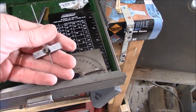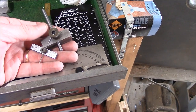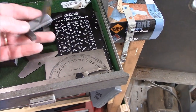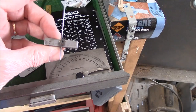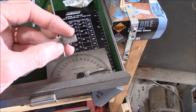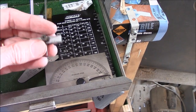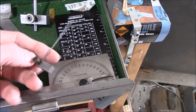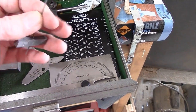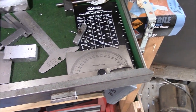These two things right here, I keep getting asked about them. I get asked sometimes how I make those. Maybe I'll do a very quick video. But there's seldom any time I'm in the shop that I'm not using this little thing right here. It's nothing but a sixteenth-inch piece of music wire with a sixteenth hole drilled through a piece of keystock and an Allen screw, with a little piece of hex brass pressed on there. This is a combination depth gauge — when I'm cutting something off the lathe, I can stick that wire up in it to keep it from falling. That's the first tool I made, about 20 years ago, and I still use it almost every time I turn the lathe on.